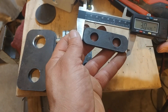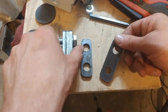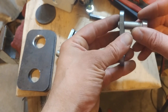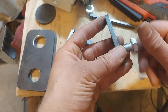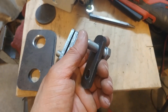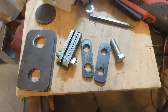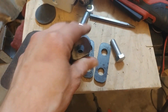Going back, adjusting that one more time, and I got this — which is right on the money. As for the finished quality on the back, very little dross. With these oversized holes I was able to fit bolts through right off the bat. I made them 0.52 inches rather than 0.5. The only thing is a little bit of tightness in the back — the hole is kind of tapered, and I'd bet that's because I don't have a torch height controller yet, so I'm probably running a little bit high. I'd rather air high than low so I don't crash the torch. Stay tuned for future improvements.